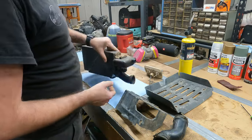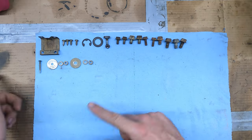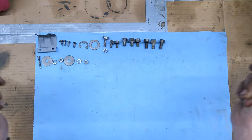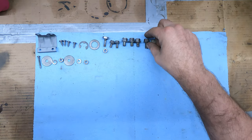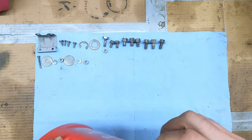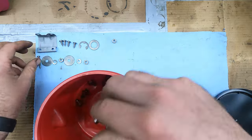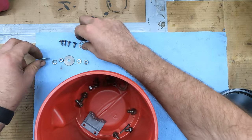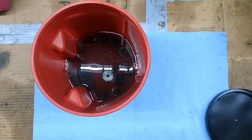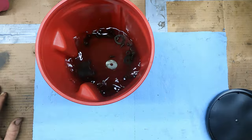All the clamps and everything look good on here, so I'm not worried about that. But these four screws in this bracket, we're going to zinc plate those. First step we need to do is hit them on the wire wheel to get all the heavy corrosion off. They're all wire wheeled. Now the next step is going to be to get the rest of the rust off of everything. I've upgraded to a coffee can and I'm going to put all of the bolts and everything in here because we're going to put some liquid rust remover in it and kind of let that sit for a minute. We're going to let this sit for half an hour or so and come back and hopefully all the rust is off of these.